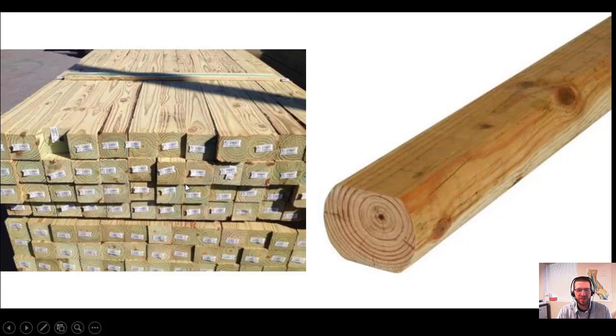In some installations you'll need a square post, like attaching against the back of a wall. Posts rated for ground contact are available from lumber yards — they're not treated with CCA, so they probably won't last as long, but they're still okay to use. What's not okay is landscaping lumber. These are not rated for ground contact and will rot away in only a couple of years. Absolutely do not use landscaping lumber — make sure it's treated for ground contact.